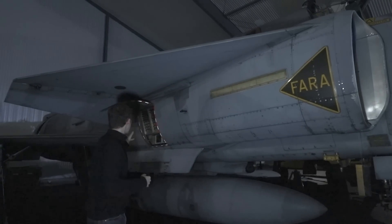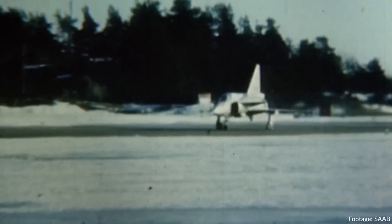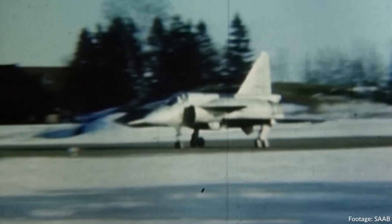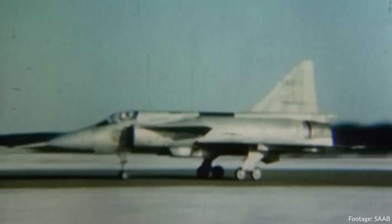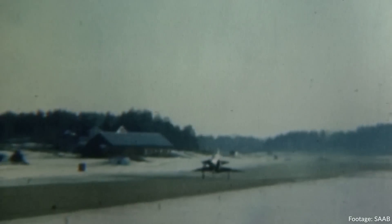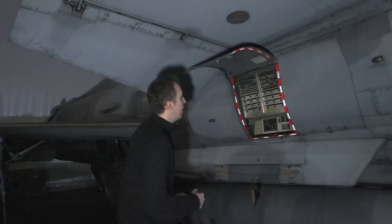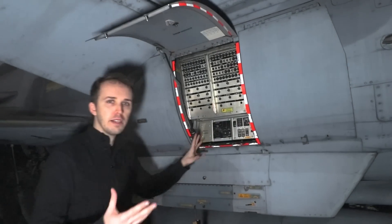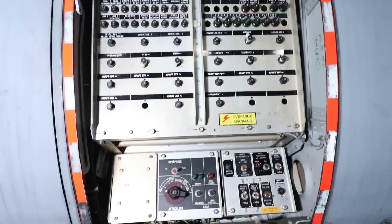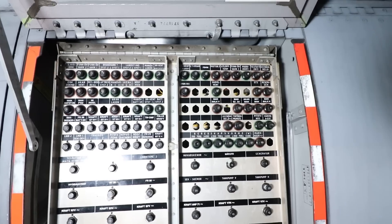What is also happening here is that because of the flaps, it helps a lot with takeoff. Basically, double delta or delta wing aircraft have an issue with downforce on takeoff, and this compensates that by producing additional lift and generating upforce instead. The museum has also kindly opened this compartment — we see this for the ground crew. We have a section here for the armament and a couple of circuit breakers as well.